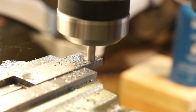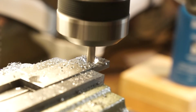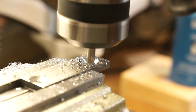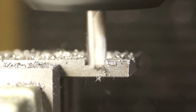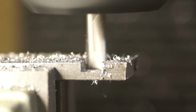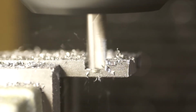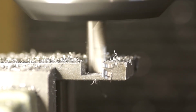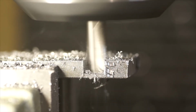What I really should have done is I should have flipped it over probably after the first very small hole, which then means I could have roughly lined it back up, and then any of the rest of the holes would have been straight through, which means the final countersunk would have lined up. But it's pretty close. I put the 6mm back in, got it lined up, just moving it back up and down, making sure it didn't catch. So I'm going to countersink it and then mill the slot.